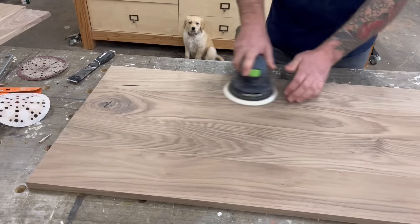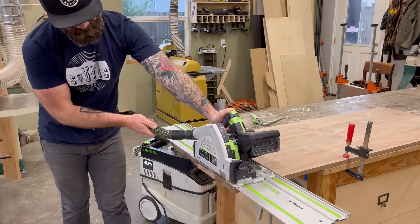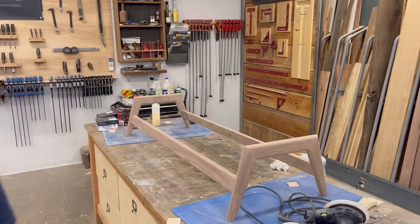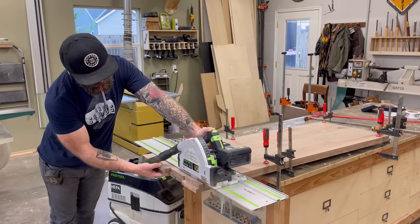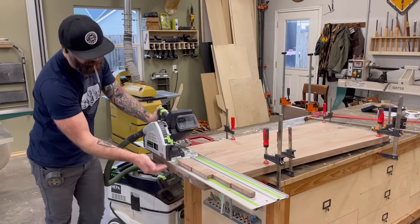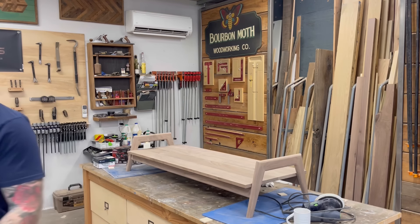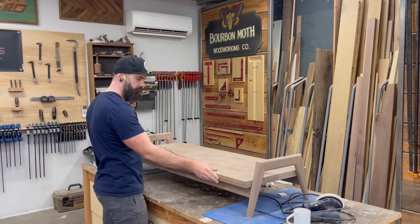We still have a lot of work to do, and that starts with the upper cabinet portion. While the supervisor looked on, I gave everything a thorough sanding after I removed it from clamps. Then using the track saw, I got a nice straight edge on one end of each of my panels. Once that was cut, I went over to the base and measured the inside distance from leg to leg — I want to make these panels just a hair smaller than that inside distance so that I'll have enough room to set the cabinet inside on top of those legs. With that distance figured out, I clamped both panels together and cut them to that length at the exact same time, ensuring both panels would be identical. Thankfully, they were dead-on — a perfect fit in between those legs.